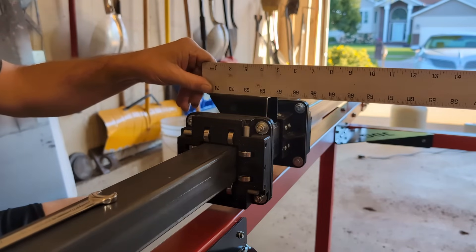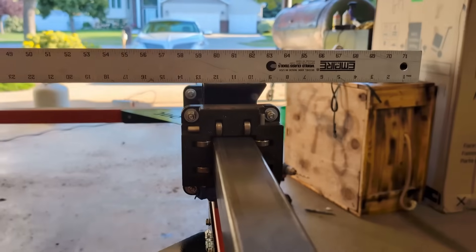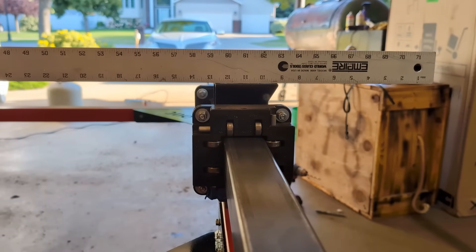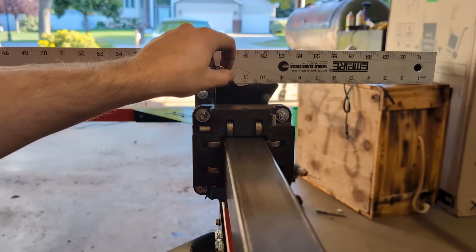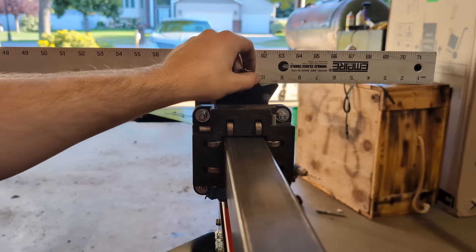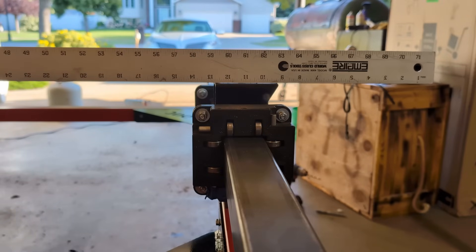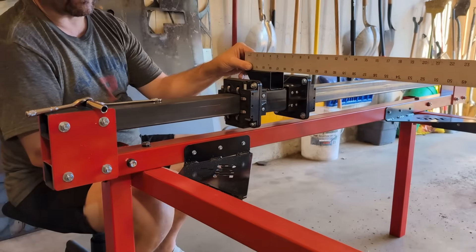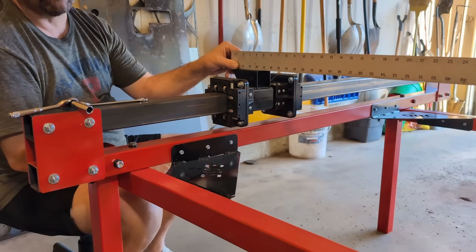Checking the other side — that side's looking a lot better. I can't get the gauge underneath; maybe just a little bit on the edge but it's pretty tight. That little bit of pressure is not going to amount to anything on these bearing blocks. That's how you level your X-axis. If you need to, you can drill out those three holes a little bit — that's perfectly fine on the other version to give you a little rock. But only do it on three holes, not four.